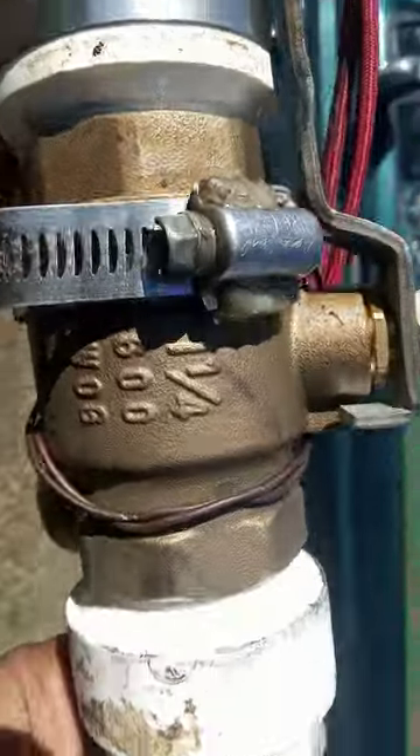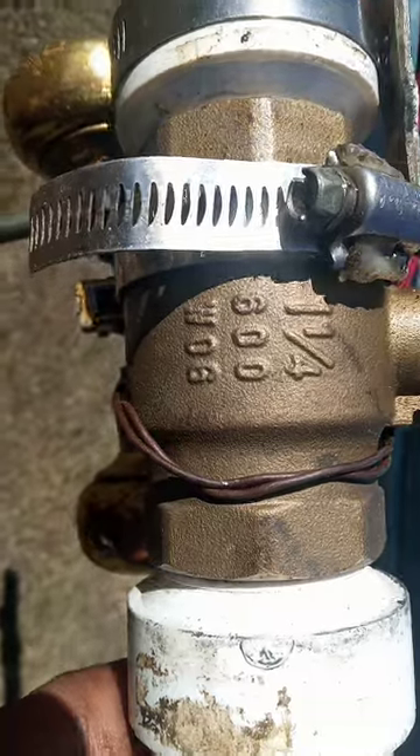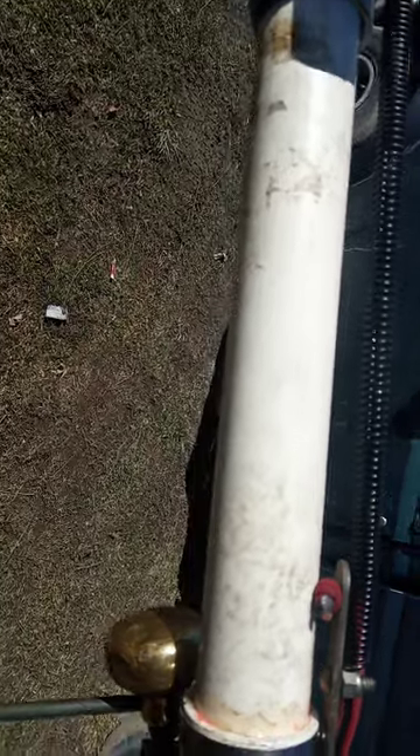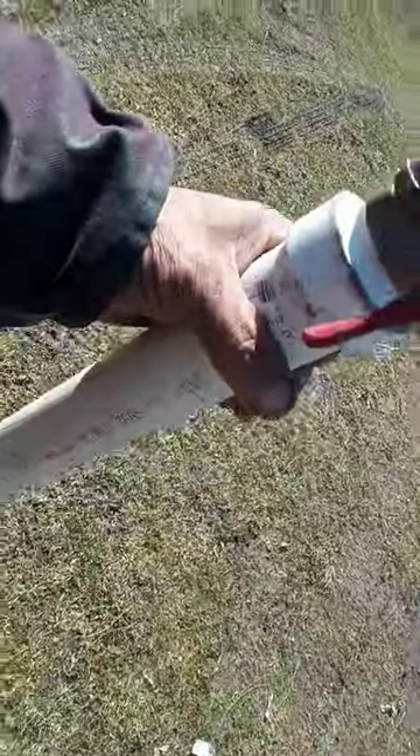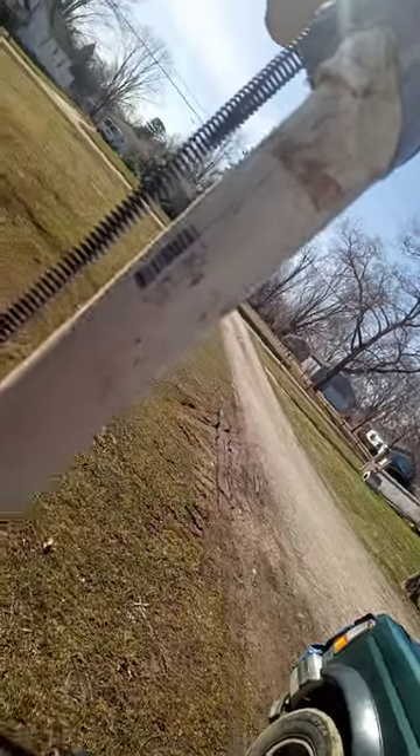This is one and a half inch Schedule 40 down to a one and a quarter brass ball valve. The actual barrel size is 18 to 20 inches, and the air combustion chamber is probably close to three to four feet long — I'd say four feet on the air chamber and about 32 to 36 inches on the launch chamber. This is how you cock it.